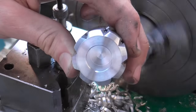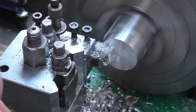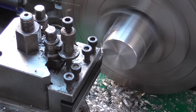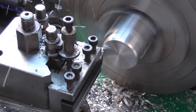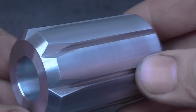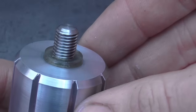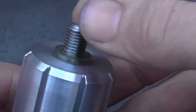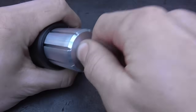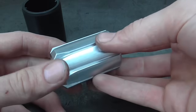Now just to drill and tap a hole in the back end - I'll do that off camera and show you when I'm done. There is the finished artefact. I'm very pleased with how it's come out; I've done a few operations I've not done in a while. After I drilled and tapped the hole in the aluminium, I Loctite'd a stud in, and as you can see it fits in there like that and it can go in a range of different positions. I hope you found that interesting - thanks for watching and see you on the next video.